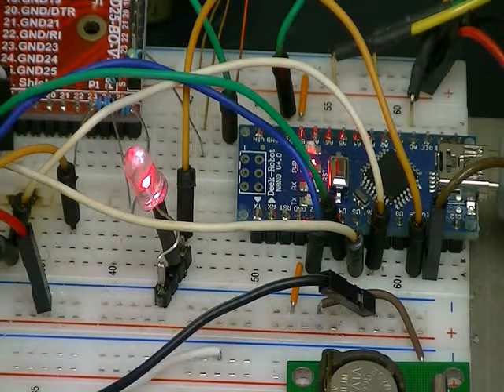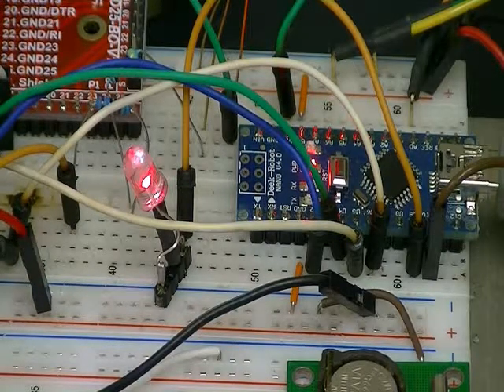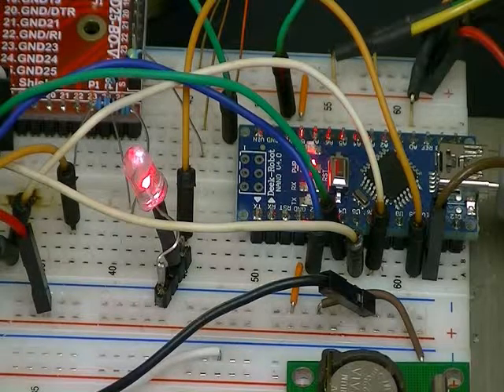You could argue the Arduino could do it directly — yes, it could. But the point of using the PC or Raspberry Pi, which work identically on this circuit, is that I could hook up a dozen sensors, stepper motors, servos, or anything I want and operate them by writing and reading 16-bit codes from either a PC printer port or the GPIO on a Raspberry Pi.